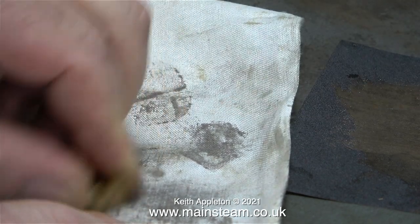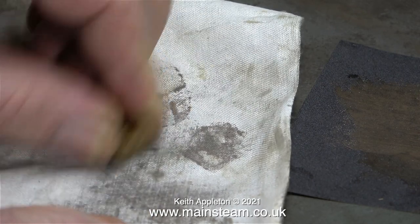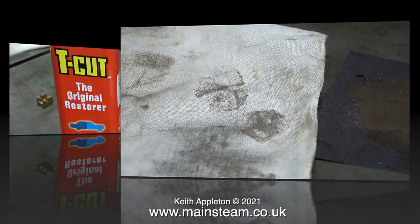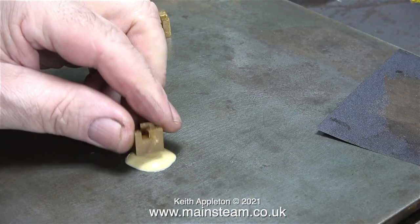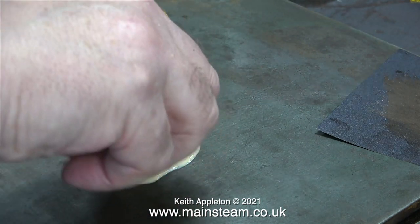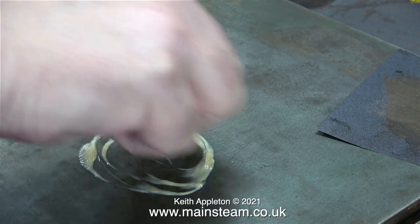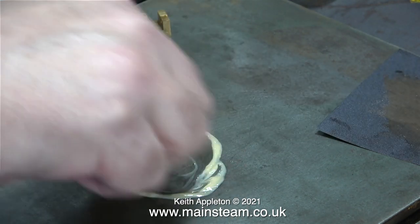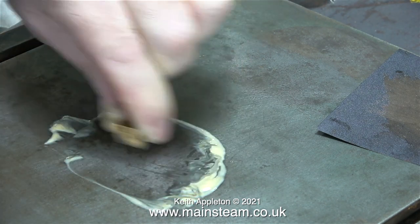After a lot of cleaning up on the wet-or-dry sandpaper, I'm now cleaning the valve on a piece of cloth using T-Cut — a liquid with a very fine abrasive in it. In the next step, which I'll do on both valves and the port face, I've poured some T-Cut onto the cast iron surface plate. No sandpaper needed — I'm just lapping it in on the plate, and when this part of the job is completed the slide valve should be near-perfect as far as flatness is concerned.